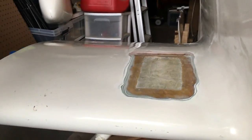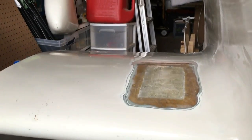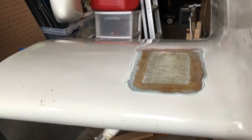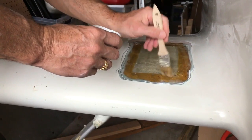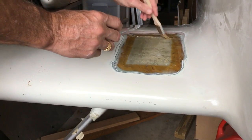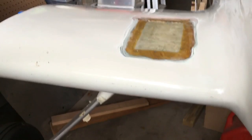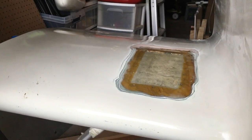We're doing the repair of the starboard wing. We had a hole here where the landing gear was converted from retractable to tail wheel. We've already done our patch — as you can see, that's the greenish light gray inside of the wood structure — and now we're wetting out the glass. Bruce is about to come in with the first layer.